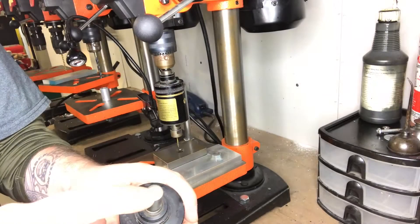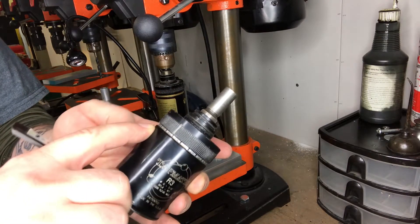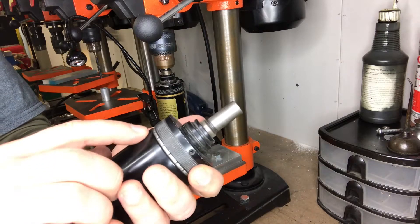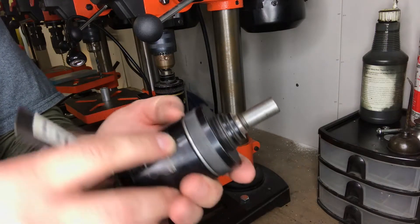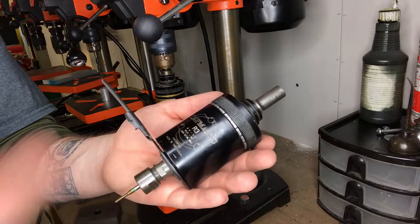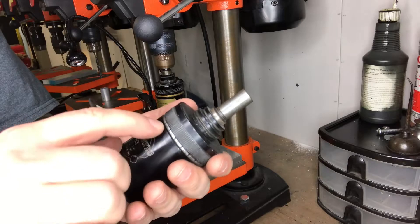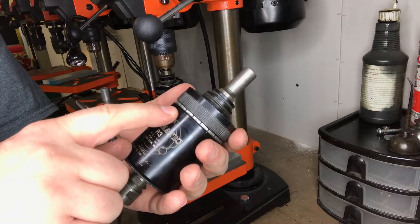This is the first one I got. The shaft on it was longer and I cut it off to fit my system. One thing to note: these have numbers on top because the tension is adjustable. A 4-40 tap takes more tension than a 2-56 tap — if you try to tap a 2-56 with too-high tension you'll snap the tap. You have to adjust the tension for your application. Also, the stickers from the factory are not set to any particular position. I called the company and they said the sticker is just for reference — so if you have a Tapmatic and it's snapping taps, check that.